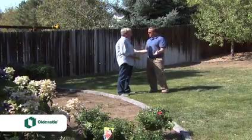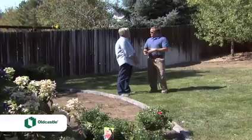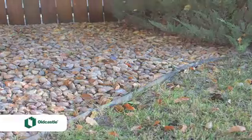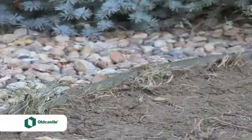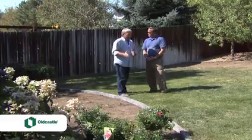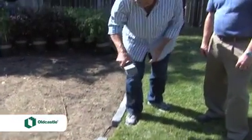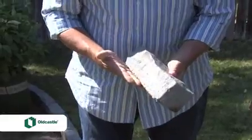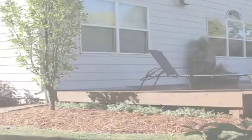I want to comment on this beautiful edging. Before, there was steel edging, and you've moved to this nice concrete edging. The owners Jeff and Jeannie have dogs, and metal edgers get really sharp on the top edge — dogs tend to cut their feet on them. The metal edger also pulls out during freeze-thaw cycles and no number of stakes will keep them in place. This concrete segmental edger stays in place because of its weight. It sits flush with the grass on one side and mulch on the other. They look great and are very practical.